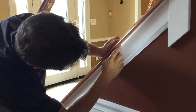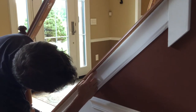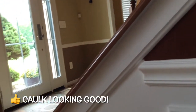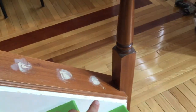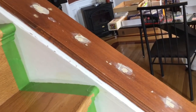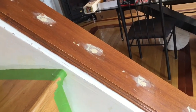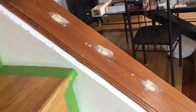I feel like there's definitely a skill here with putting caulk on that I have yet to master - it's certainly a challenge for those of us who don't do it every day. Here we are with our finished caulk lines all the way down. Looks like we're in pretty good shape on both sides. Don't feel like you need to be perfect - you don't want any big bumps or stop-and-goes, but you're going to paint over some of that stuff anyway, whether it's the white on the side or the black we're going to use on top.